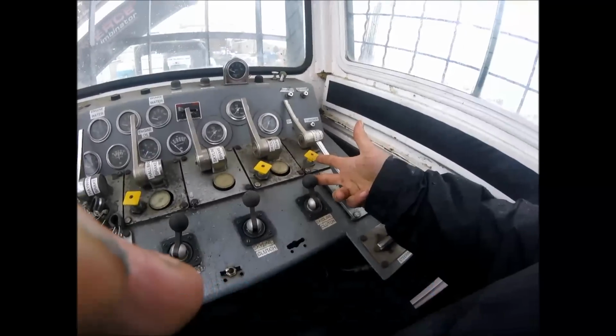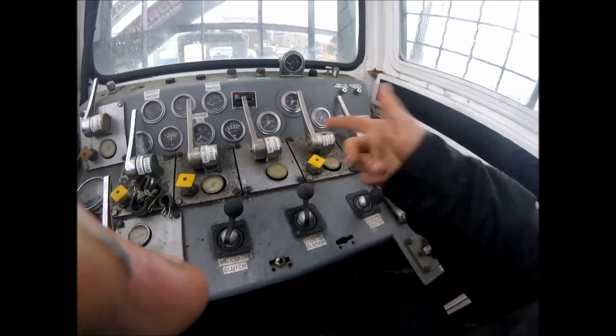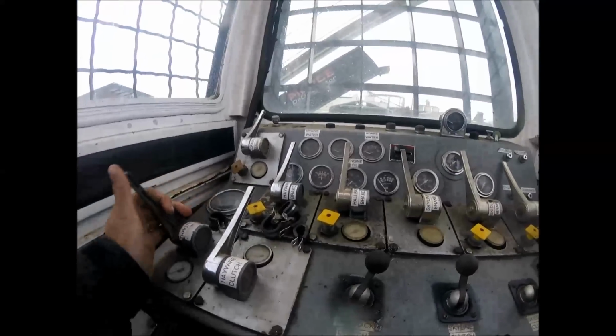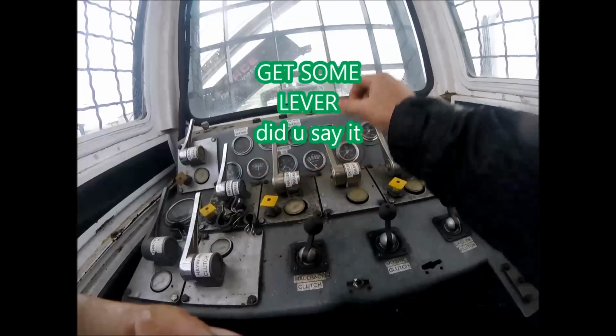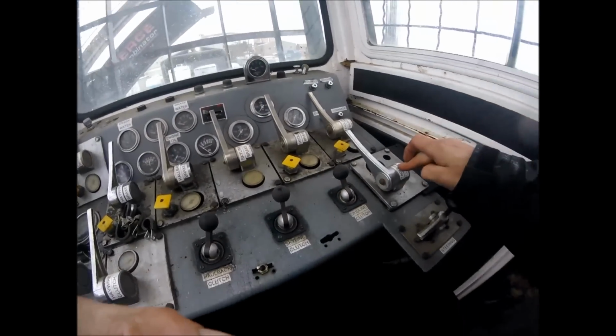Right here is your friction. You're ready to go ahead on the skid line. You just pull that in. Throttle's right there. Start giving her the juice. Now there's the Skyline friction, the haulback friction. Here's your Haywire clutch. And then a tagline.